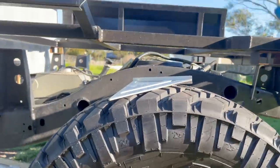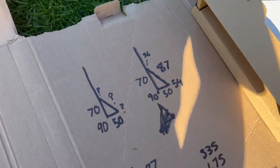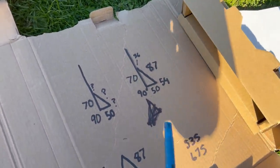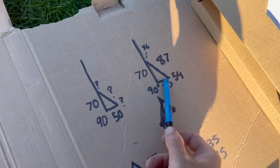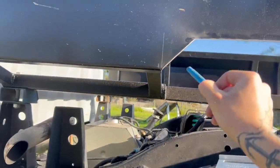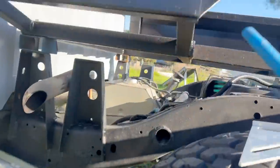I'm just going to tack it up the top and hold it on a 36-degree angle there, and I know I need to cut it at 87mm wide and it'll sit dead level with the bottom and be sitting out 50mm.